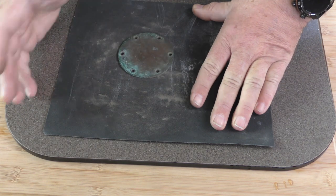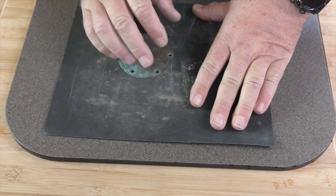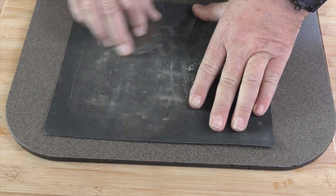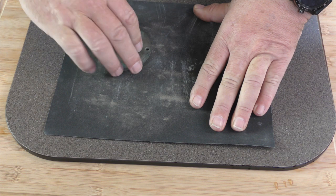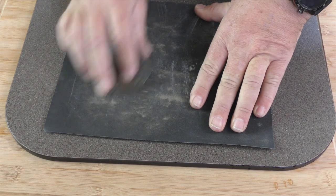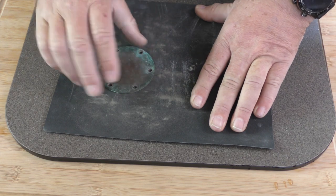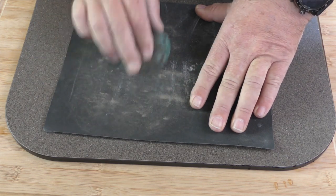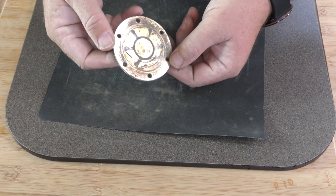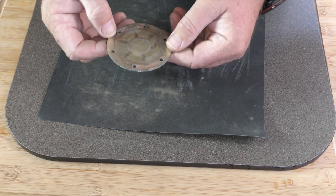Now, it doesn't have to be perfectly flat, but something like this Corian top is much flatter than this chopping board or board extension we've got on the boat. And you just figure of eight, turn it 90 degrees, figure of eight again. Now, this is on 320 paper, figure of eight, 90 degrees, and you'll see this is coming up nice and evenly, look, taking off the high spots. You just keep going, obviously don't go too mad.